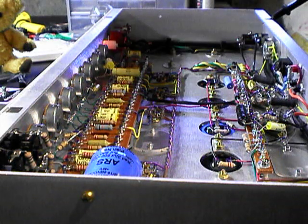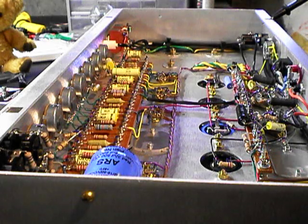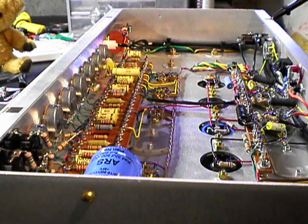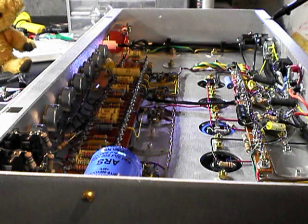As we've read from my test ports, I'm at 38 milliamps, which is pretty close. I tend to like around 38 milliamps for the sound of my amp — my clone.